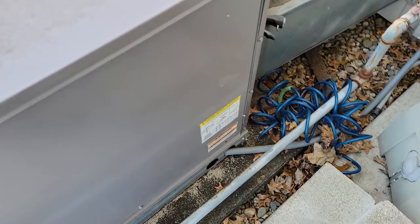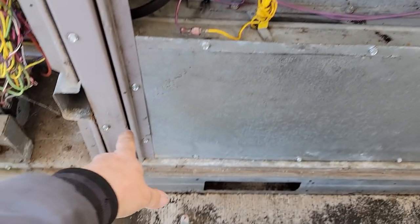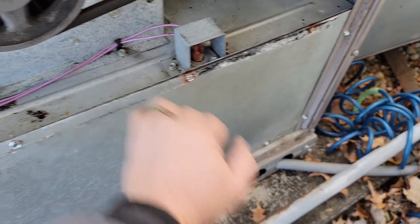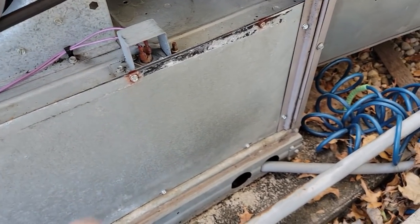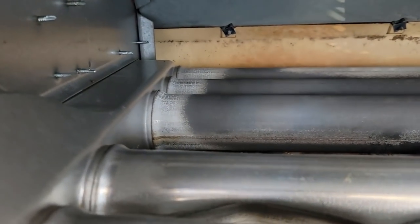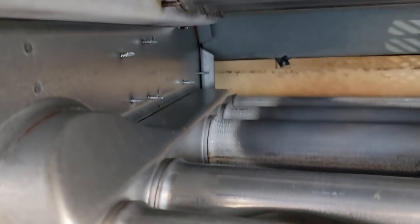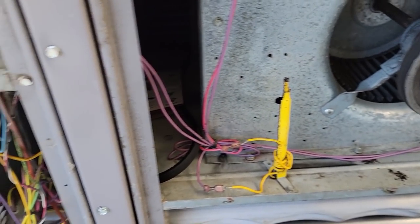Let's go ahead and power it off, check the belt and stuff. We'll get in and check that heat exchanger. The belt's nice and tight — don't feel like anything's bad there. But notice these screws are all nice and shiny, almost to the point where they've been taken in and out so many times they've been stripped out. Got the mirror out, got way back in there, looked around really good. Even though it's a little darkened, there's nothing that looks bad at all — everything looks really good, checked around the top, everything was clean and clear.